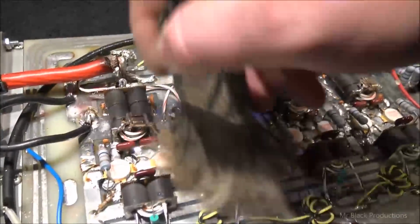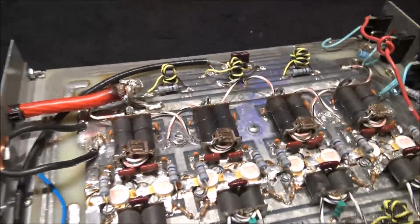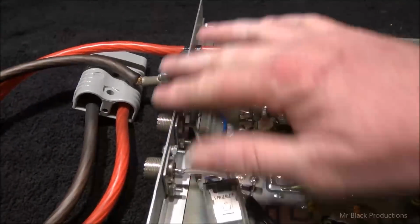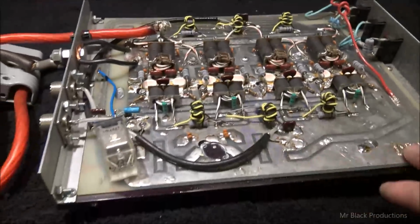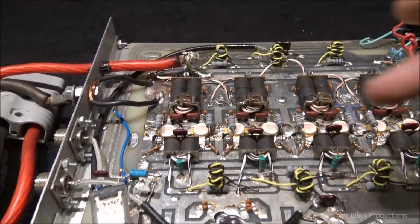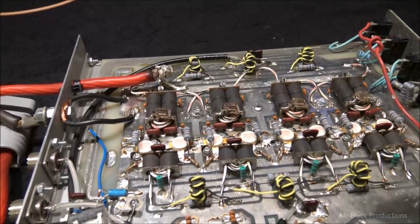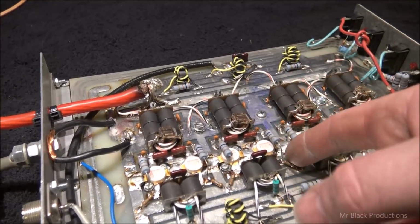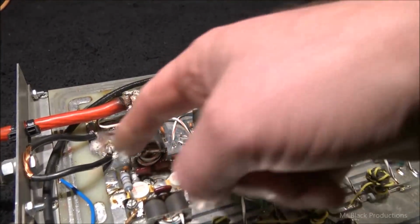Now, usually with these 12 packs, we'll find that there's going to be some heating issues because of the poor ground. What you'll find is that this bolt is more or less passing the ground to this piece of metal, which is attached to the heatsink. The ground current flows up from the heatsink because it's the shortest distance with the most amount of pathway. These attachment points to the heatsink help flow the current over to the transistor, hence the reason for these big traces. There's another one that runs up underneath here and up through here. It's a big distribution network.